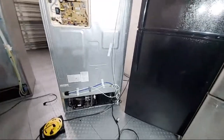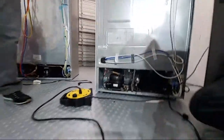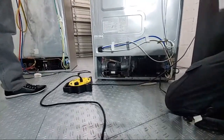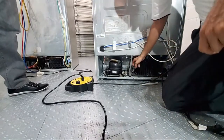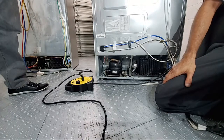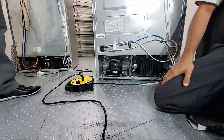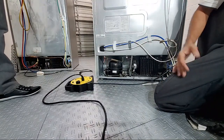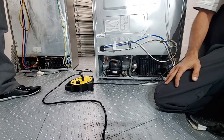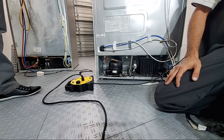What if I come to a job and this condenser fan isn't running? What would be the desired test we should conduct? Voltage to it. Now, what happens if we get the 12 volts DC, apparent on our voltmeter, and it's still not spinning? You changed it, that motor's bad. Yeah, the fan is bad. Did that answer your question? Yeah, pretty much.